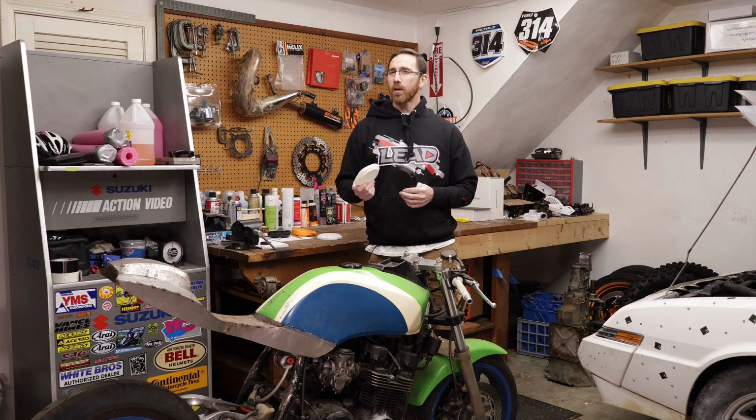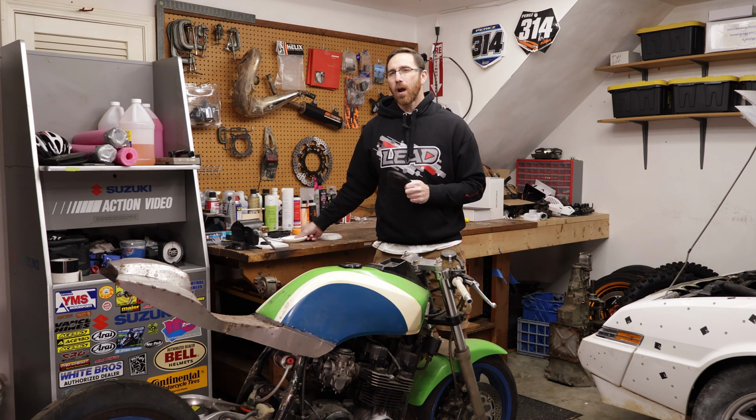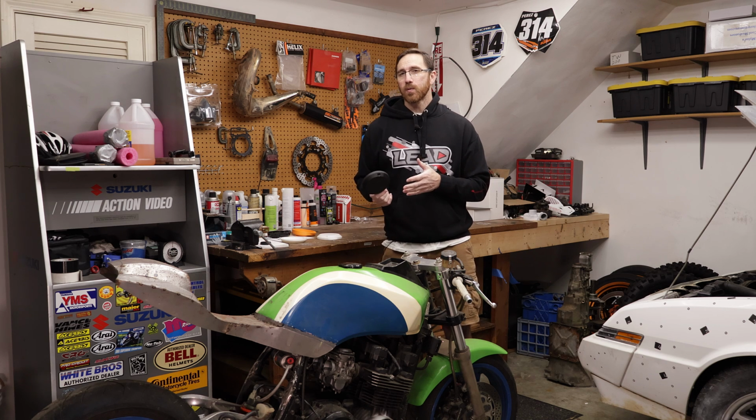It would probably work as an end-use part, but the CF material actually has a little bit better surface finish and it's a little stronger. So the mechanical properties of that are much better. I would say stick with a PLA material while you're doing your testing and your test fitting. And then if you are happy with your end result and you want a final part, then look into some other materials that'll fit your specific needs.